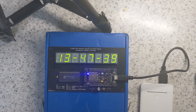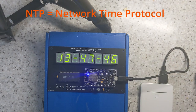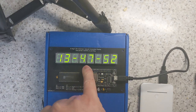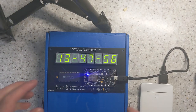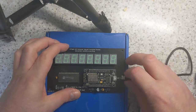So for those that haven't seen this before, this is basically an NTP clock. It's something I made myself, using an ESP8266 module and an LED display driver, and of course seven-segment displays. The PCB I designed myself, and I'll just power it off and on again to show you what it does.